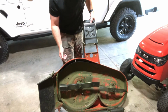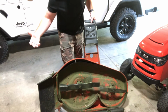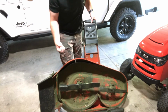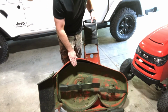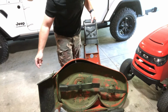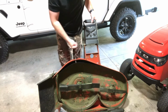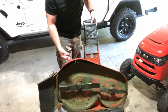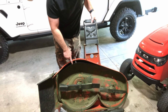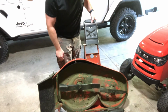But I do know, when we're transporting things with a fluid, air is basically a very low viscosity fluid, and we've got grass entrained in that air. Velocity is important to make sure we're keeping that grass suspended in the air and moving it through. If we go too slow, that grass will drop out. If we go too fast, the air will take off and leave the grass behind and plug up. So I'm interested to see how big of a difference this makes. I was still getting a few plugging issues in the chute here, so maybe this is the ticket.